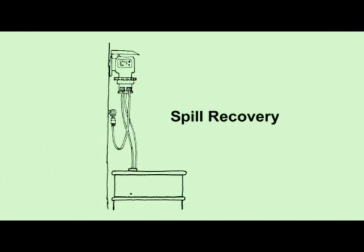To help prevent chemical from collecting in the tube housing, which can cause the rollers in the roller assembly to seize and damage the tube, and to reduce spillage on the floor, a spill recovery can be set up using a section of quarter-inch suction discharge tubing inserted into the tube housing cover. The tubing will help drain chemical back to the tank in the event of tube failure.